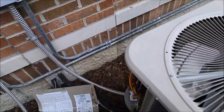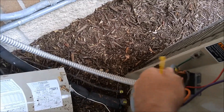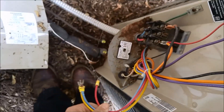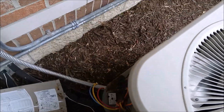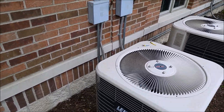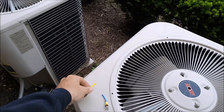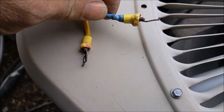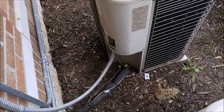So it was an entertaining call first thing in the morning here. Look at that — just pull the wires right off. Pull the wires right off there. It's crazy. Basically that's all that was. Got the contactor off, cut the wires — you can see it just melted. So that was the source of my problem.